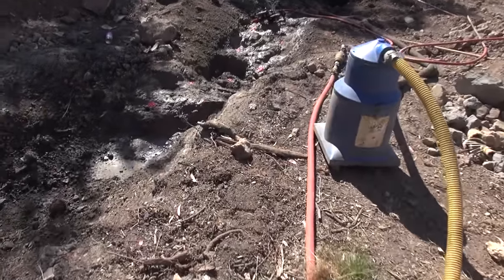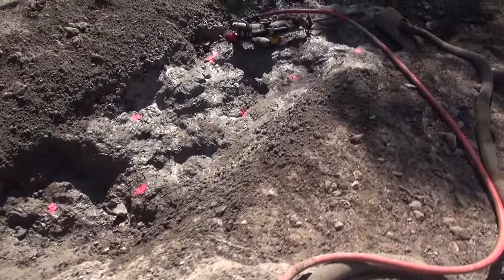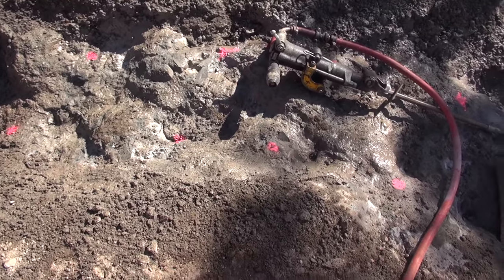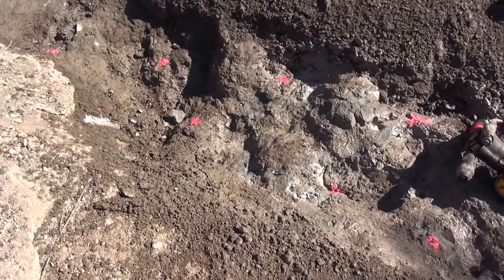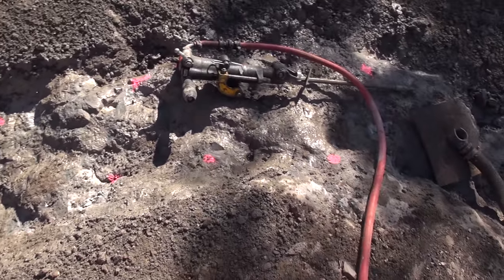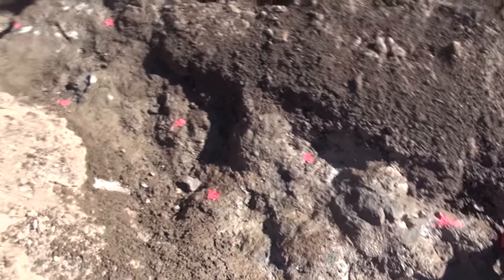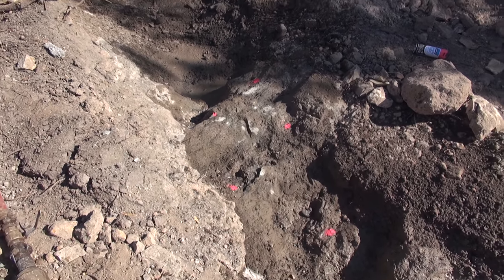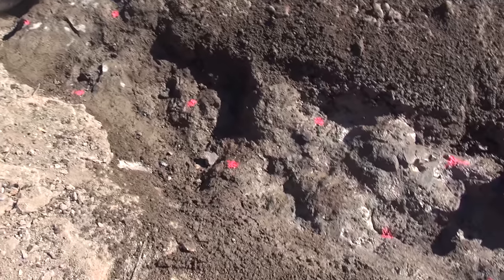Rightio, just got to smash out a bit of trench this morning in some Colorama Rhyodacite rock. It's one of the local Rhyodacite formations that can be really hard. This bit here seems to be quite hard, but also a bit crumbly. Lots of very, very small, closely spaced defects in it. Hence the hammer's been able to bash a lot of it out, some of it not so.